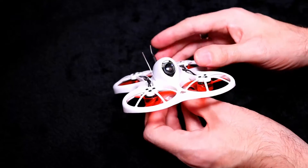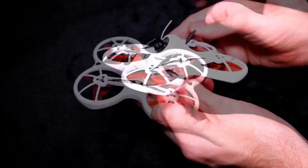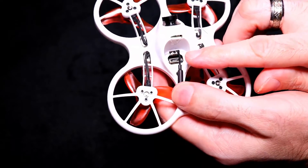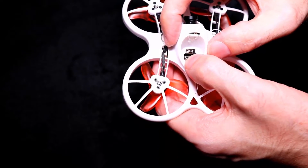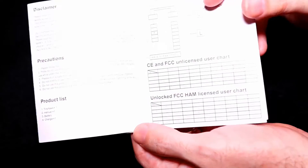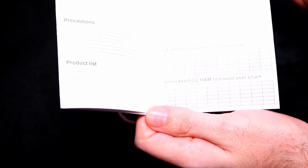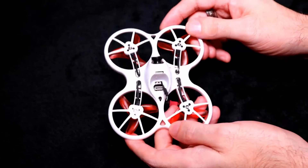The camera seems pretty decent, but it doesn't like darkness so it could do with an upgrade. The VTX is a 25mW unit and it comes locked. It has 37 channels, and to unlock it, press and hold the button underneath, plug the battery in, and you'll see blue and red lights come on — that means you've unlocked the full potential of the VTX. It also has smart audio. I accidentally changed a channel in smart audio and got a blank screen, but I managed to save the default settings.